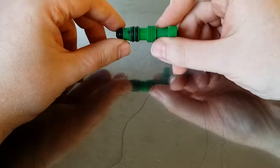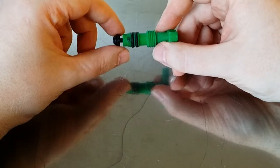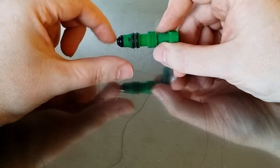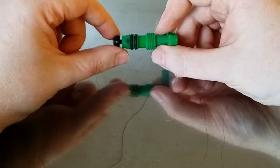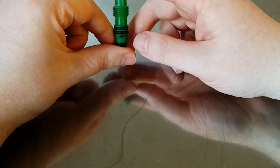The spring is gone, but it might still be interesting to see this thing. Usually under spring tension, it will seal the cylinder for gases being forced in, but not from gases being forced out — so it's a one-way valve.